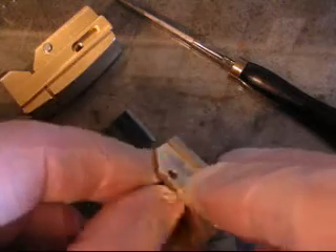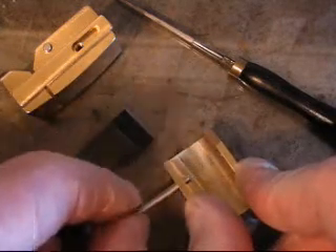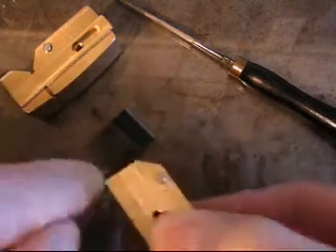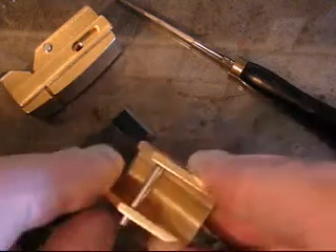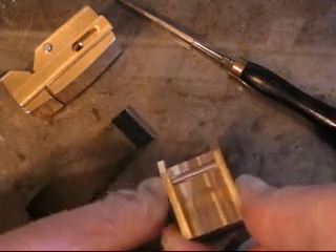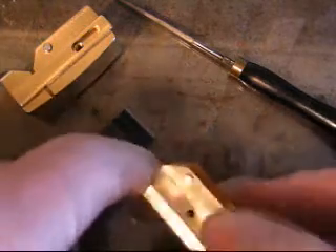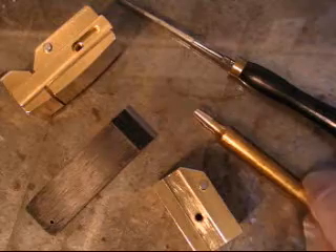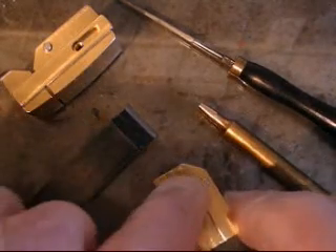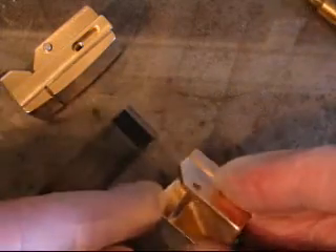The point of the video is to demonstrate how accurately you can drill holes. There is the hole, there's the pin — hardly any slop in it. As you push it in, it's fallen in by itself, which is unusual because before it was always stuck. We'll lock-tite it in. The pin itself is five thou shorter than the overall width of the body, which means when I press it in with the homemade punch, gauging by experience, when it's two or three thou down beneath the surface, it will naturally be centred between the two sides of the body.